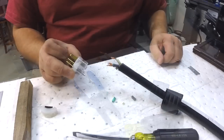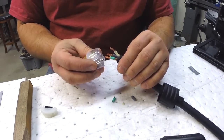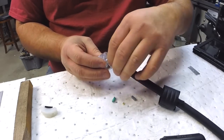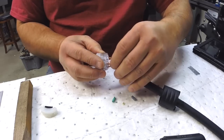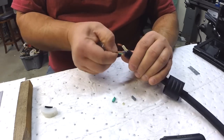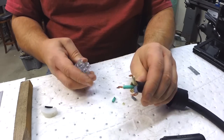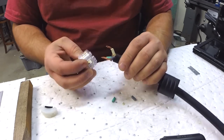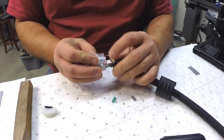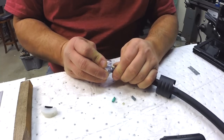I'm going to go get a different screwdriver. All right, we got our screwdriver now. What you do is you just shove these guys in place into these holes. I kind of want to get it pre-worked. Green goes on the bottom, which is ground, in this configuration.